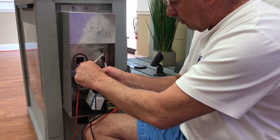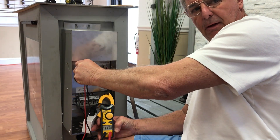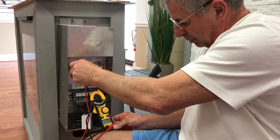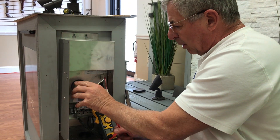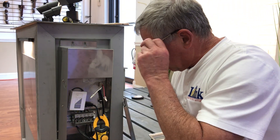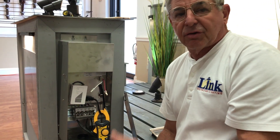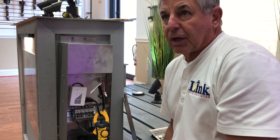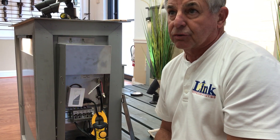Let me show you why. We're going to go in and check the primary side. The reason we're getting such a low reading is — can you see that, Brian? — on the primary side we're only inputting from the receptacle 117 volts. So it's still going to be a factor of 10, we're going to be a little bit off our 120, which we were. You need to know that when you're setting up transformers, because the first thing you're going to say is 'I got a bad transformer.' It's not a bad transformer — you're just inputting less. It can be 5% less, it can be up to 5% more, so you could be putting out 125 volts. It's okay, don't get hung up on that.